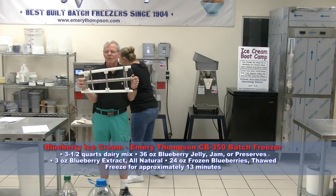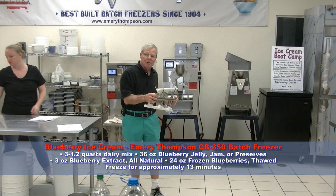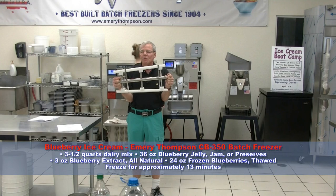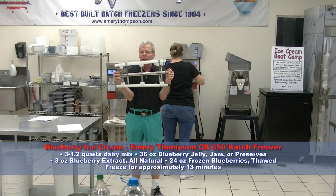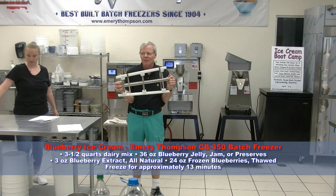And the springs are what push it out. The old blades we used were thrown out by centrifugal force. But when I started slowing down the machine with the infinite overrun control, they're not scraping the walls because they're falling away because of the low speed. With these springs, it doesn't matter if the blade is 1 day old or 3 years old. It's still going to push the white Delrin blades against the walls with the same amount of force. Our old blades had to be sharp. Everybody else's blades, they're also Delrin, have to be replaced every 6 months. 6 months. And they cost as much as ours that go 5 years.